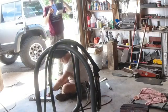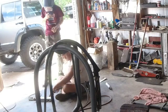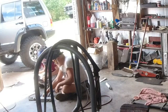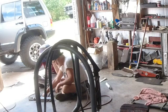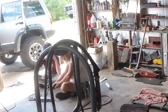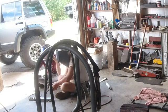You see what I'm doing with these little welds? Just getting a little spot weld on there. But if I get one, this one here didn't take so much. You can see it's got a hole in it. That's where it bubbled. But if I get one pretty solid looking like that, that looks pretty good. Keep in mind, if I was trying to do a continuous weld, I'd go like this over here and get a hole in it. That's why I do these little spots.